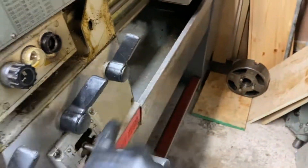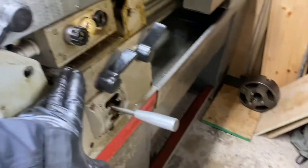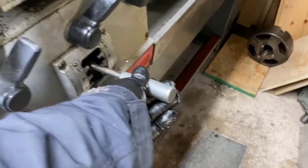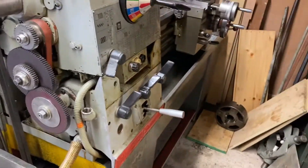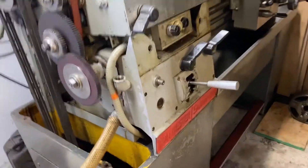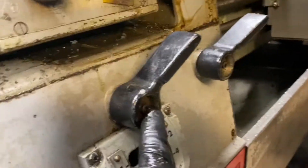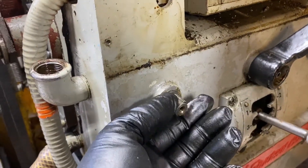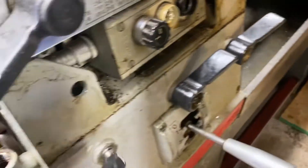I'm going to pop these caps off and show you under there. These are imperial - they are three-sixteenths. There are six of them. I generally leave them all in a neutral position, opposite your three and your four, because there's a set of sliders under there and it's easy to get it off. These are 5/32 imperial allen key - just undo the cap head in the middle and they will just prise off gently. They might be a little bit sticky depending on how many years they've been there. Watch out, there's a key in there - watch you don't drop any bits.